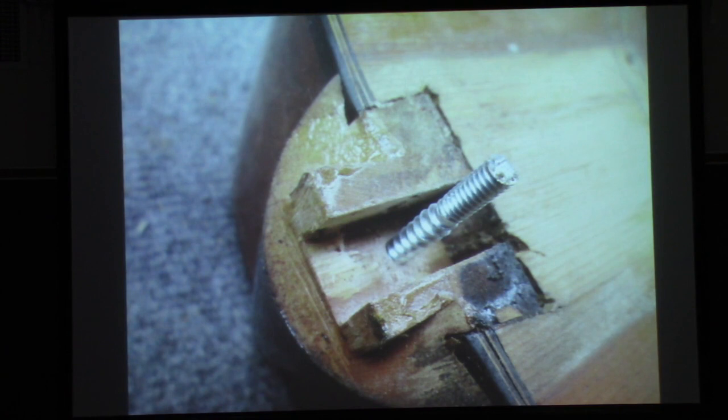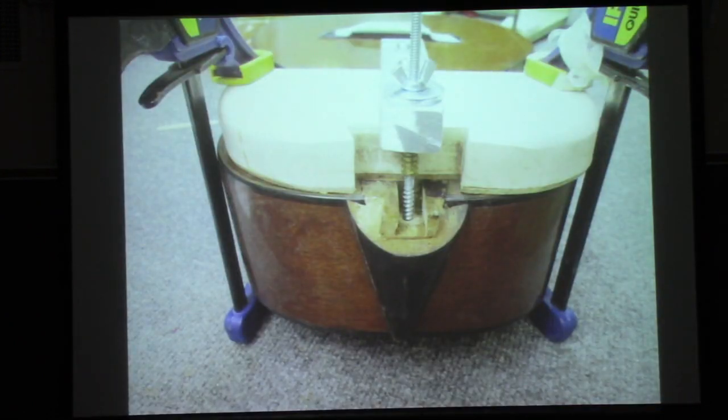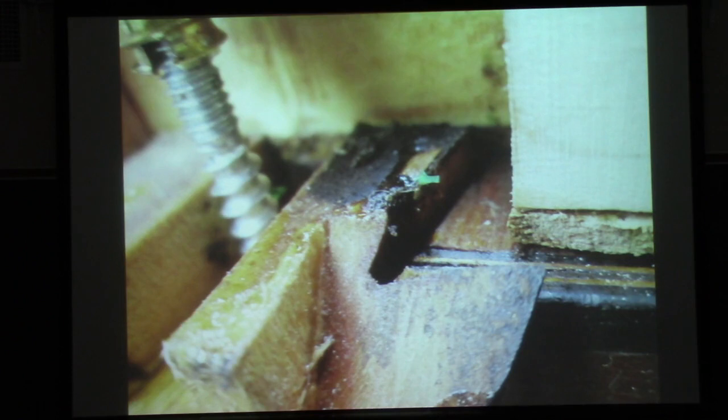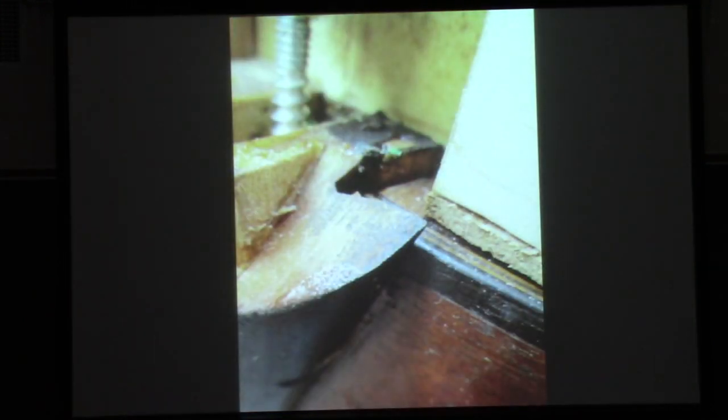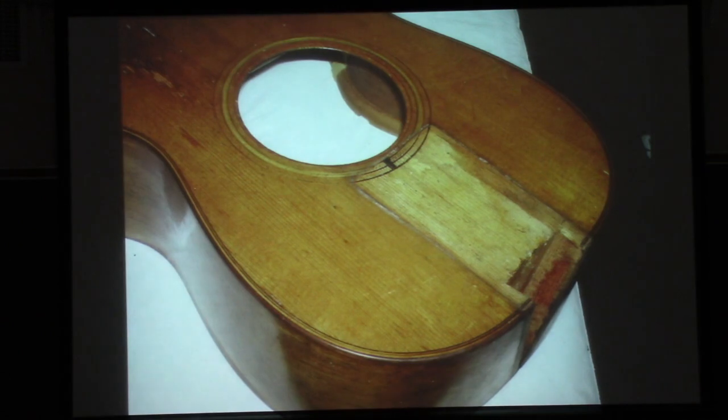It would have looked terrible. So the bolt that I put in there was actually a hanger bolt. And that allowed me to put this little kind of coupling on there and make this jig, which I have right here if you want to take a look at it and pass it around. I just made that jig because I got into this situation. I was like, okay, what am I going to do? And I put some steam down in there and very gradually tightened up the wing nut on the top, and that cone came out without incident. So that was just a way to get out of that situation. There it is. So I kind of bailed myself out.